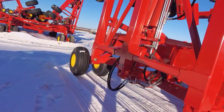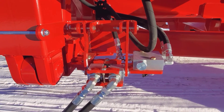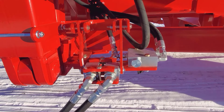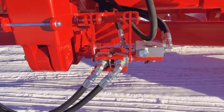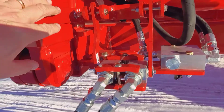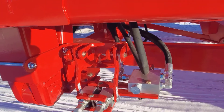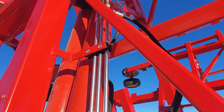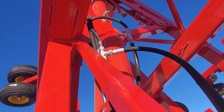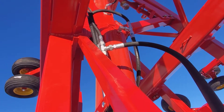So how do we control the direction? With this 66 foot drill, we have two ball valves — one controlling flow to the inner wing cylinder, one controlling flow to the outer wing cylinder. When the wings are up in the air and we want to apply pressure to the base end of the inner wing cylinder first, that ball valve would be open and the one to the outer wing would be closed. We feed the inner wing first, allowing that flow to push on the piston within these two large cylinders on the inner wing and extend the rods to unfold it.